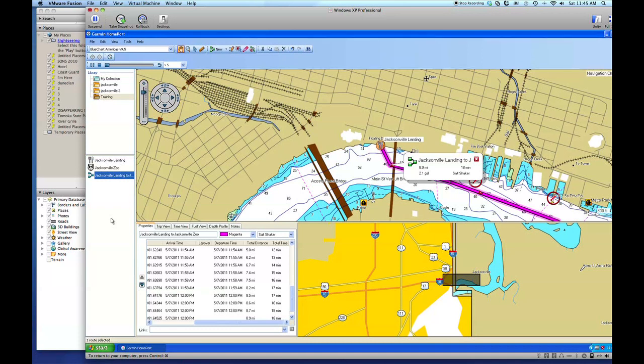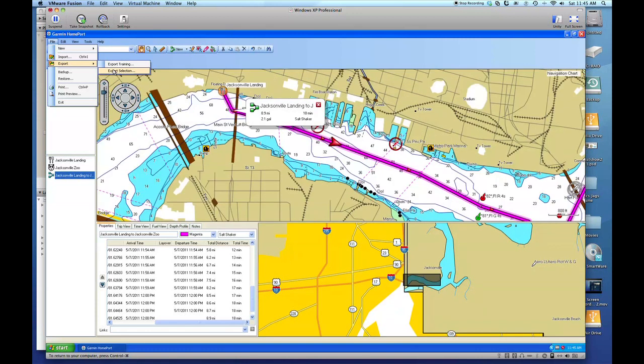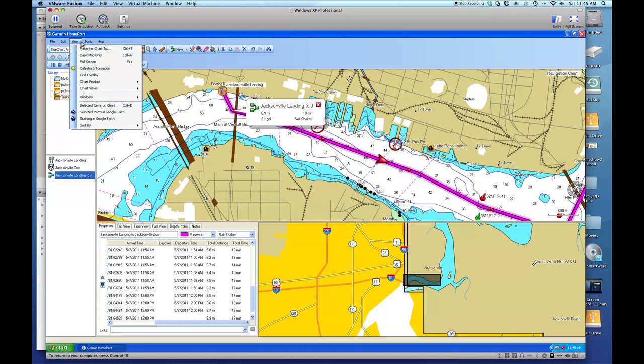So that's it — I've got two waypoints and a route. At this point the only thing I want to do is send it to my chart plotter. We can export. I don't have a chart plotter hooked up so it doesn't show, but we can go up there and see that we could export it to our chart plotter. The easiest way is Send To — if your chart plotter was connected it would show up on that list and it will load those over. If you have an SD card it'll put them on the SD card. You go to your chart plotter — your 440 or whatever you're using — go to Manage Maps and you can replace it or add it, however you'd like. Very simple, very easy to use.